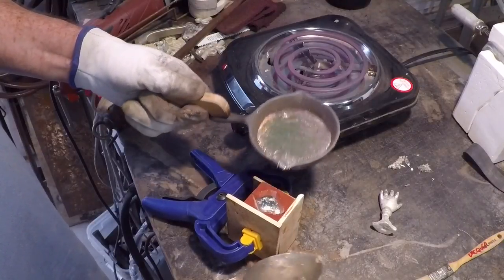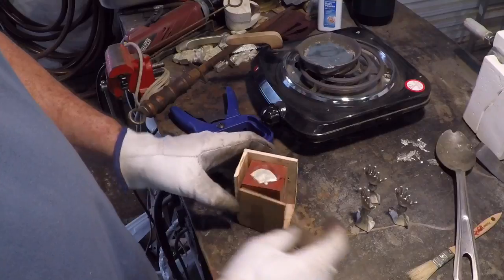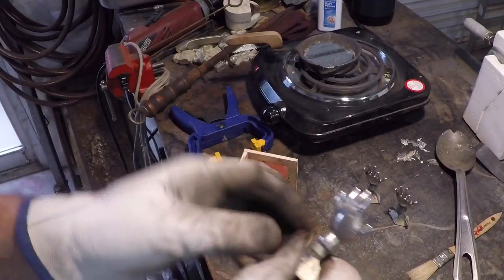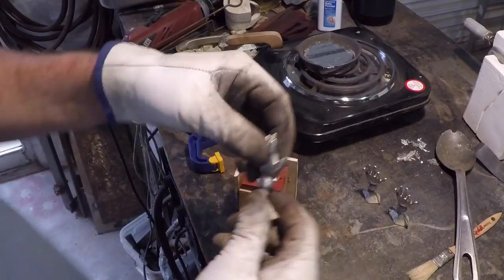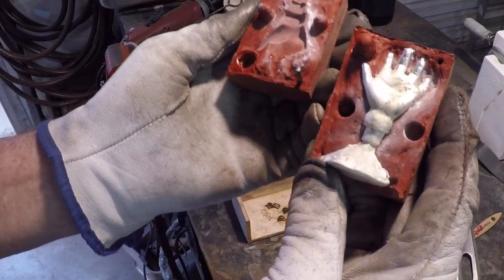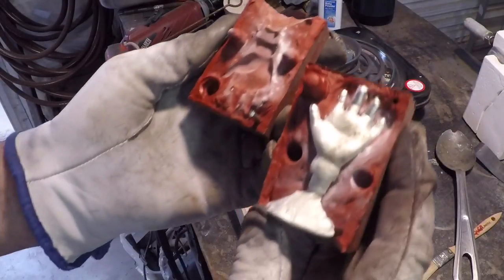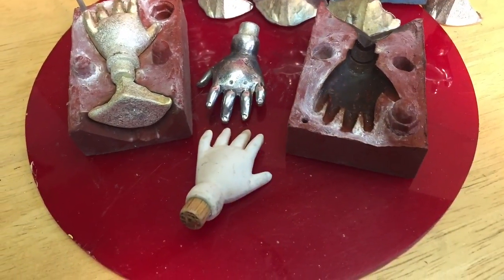At the melting table I've got the mold clamped in the box and I'm tapping it with a spoon to make sure the metal gets down into the fingers. Amazingly, the first three castings all came out pretty good. I polished them with light sanding at 180 grit, then wool, then the rag wheel with polishing rouge — I left the sprue on as a handle while polishing. Casting number four also came out very good — no voids, fingers look good, just a little flash between the fingers that cleans up easily. This is one of my most successful pewter casting projects. If you saw something I could have done better or have something to add, please leave a comment below. Thanks for watching.